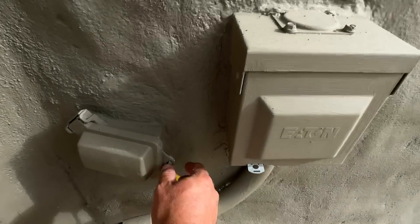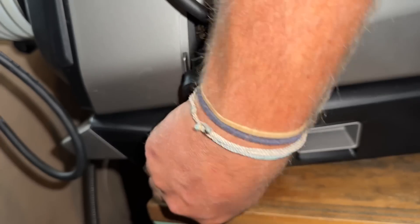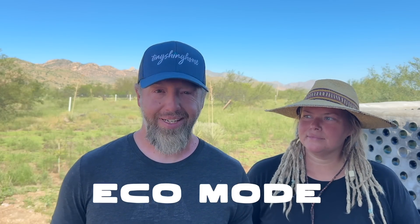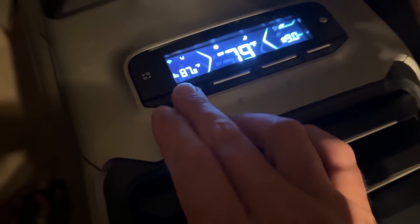We were still worried about running this overnight because we had just put the mini-split in the Airstream, so we were using more power overnight. But we had just added more solar on the roof of the Airstream cover so we were filling back up quicker. This was all very new and we were worried about adding another 300 to 500 watt draw overnight with the Wave 2. So initially, before bed, Adelaide would disconnect from AC power, plug in the battery, and run it on fan mode only. This used very little power, but the temperatures would obviously creep back up overnight into the high 80s. We really wanted a better experience for her, so we experimented and finally landed on eco mode. If we've been running the Wave 2 all day, the temperature's pretty stable in the dome. At night, we switch it over to eco mode and this is proving to be a much better combination of cooling and efficiency — gets it down in the 70s. And this means we're running three air conditioners off our solar system.